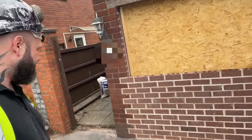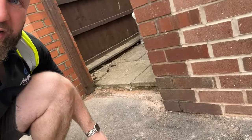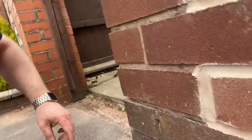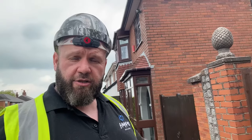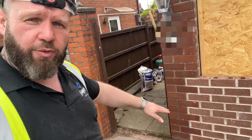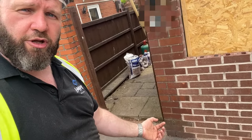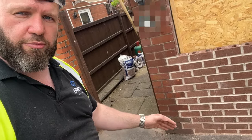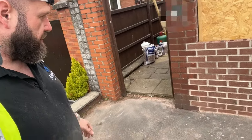So we have taken the original DPC — the way we find that on these particular houses, if you come in a little bit closer, you'll see a little bit of a black line. That black line is generally asbestos or plastic, and that's the DPC. That's the height of the floor we're going to try and achieve. It's there in the brickwork to stop damp coming up through the bricks via capillary action — it hits that and can't pass through, so the bricks above stay dry.